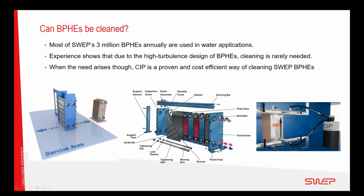With the braze plate heat exchanger instead, being a metally locked hermetic pressure vessel, we can handle up to 650 psi working pressure. They are tested in our facility up to 1000 psi before we ship them. It's possible to use cleaning in place with a much higher pressure and much higher velocity than the typical gasketed heat exchanger.